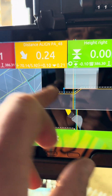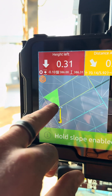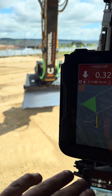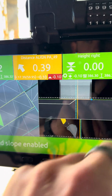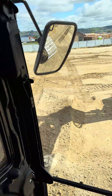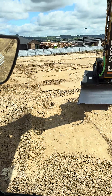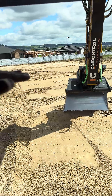If you hold slope underneath the batter on the lower side, it's going to drop down to that lower pad level to hold that slope — but that's not what I want to do. So I come across, select the right-hand side, hit hold slope, and now I can over-cut the pad all the way across.